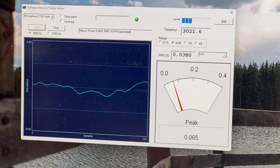I believe this is the chrome switch. Hopefully these parts don't go flying. Desoldering these things was not fun, but I did get them out. So we're gonna do this. These three up here, I will probably just, well, maybe I won't shoot contact cleaner in them like I did for the monitor switch, but we'll see.